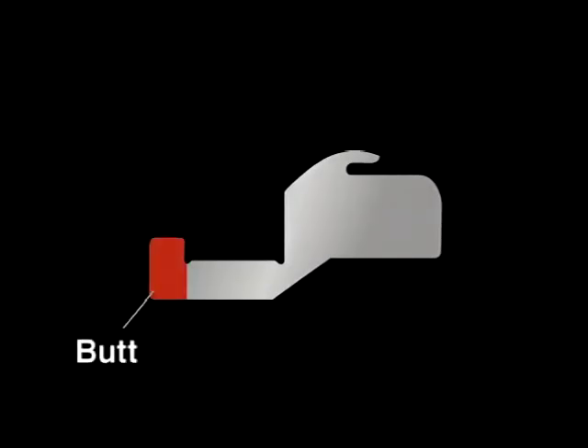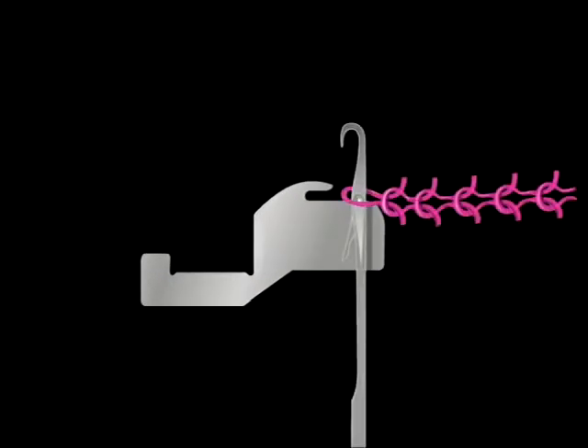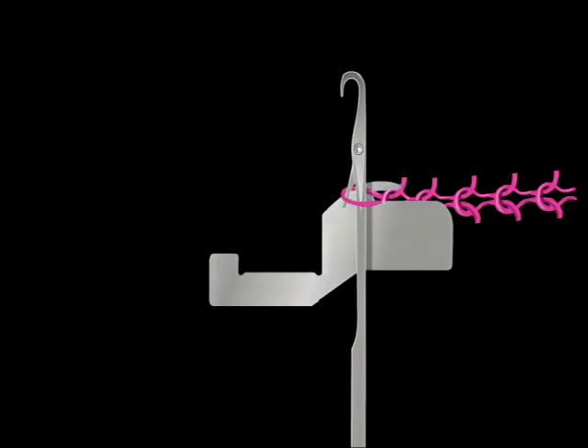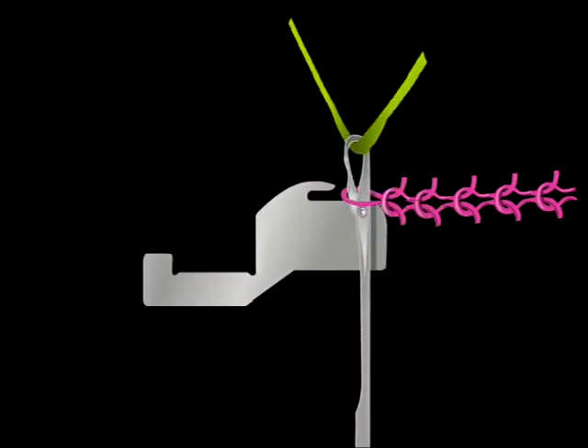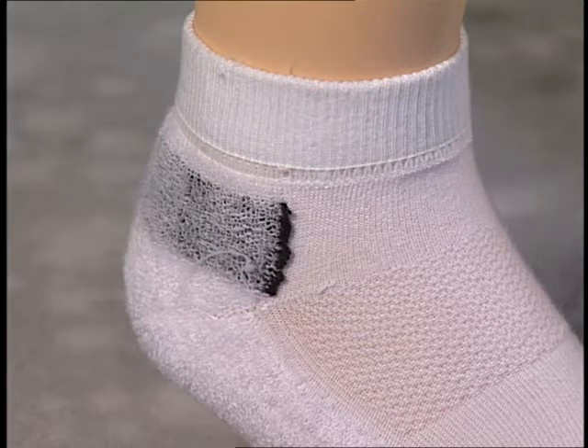It's called a sinker — a thin steel element with a distinctive shape. A sinker has a butt with a place to insert a cam. It has a hold, a throat, and a nose. As the needle goes up, the sinker moves in to catch the sock fabric in its throat. Since the fabric can't go up with the rising needle, the old loop clears the latch. When the hook catches a feeder yarn and the needle moves down, the sinker moves back out of the way and knock-over, cast-off, and stitch forming takes place. As the new stitch is formed, the fabric rests on the top of the nose. In manufacturing, the sinker is specially designed to form terry loops on the inside of the sock, which provide cushioning and are discussed in detail in the sock component segment.